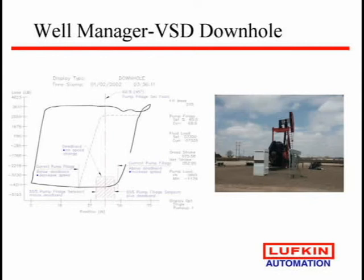You get to set this area. You get to set whether you change it every stroke and by how much speed you change it every stroke. You also get to set the maximum and minimum speed. We would like you to take one of the rod design programs and verify that rod string — how slow and how fast can you run it to get the proper window.